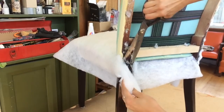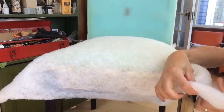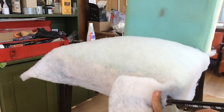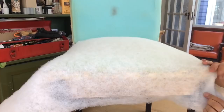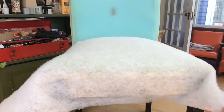Now we have these corners to deal with. Wrap the side around to the front like this, pull it down so it's nice and tight on this corner, and staple it on the front edge of the chair making sure you're not stapling anywhere you're going to see it. Fold that over and anything in here that's going to be in your way can be trimmed away. As a general rule you can use your finger as a guide — as long as you have a finger width here and a finger width here, you can cut all the rest.